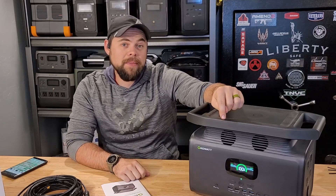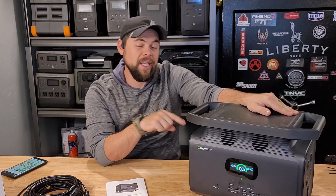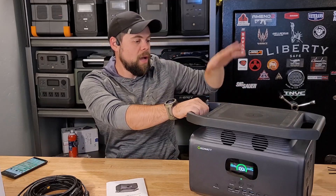It's a 1512 watt-hour battery. Internally it's lithium NMC — lithium ion — which means you'll get about 800 cycles out of it. The manual does say you can connect up to three units together to increase battery capacity, but nowhere on their website or manual does it say that increases the inverter or solar input capacity. It seems to be one master unit with up to two slave units, where the master handles all output and solar input — you can only expand the battery. But that is a cool feature, and the expandability actually moves it into the mid-cap class of solar generators.